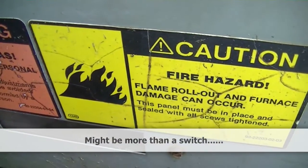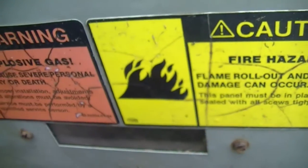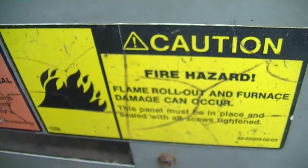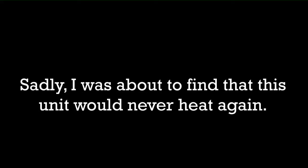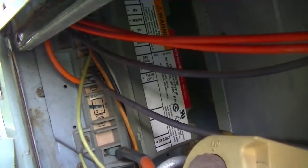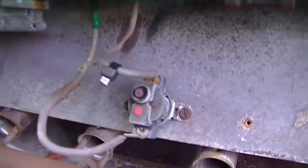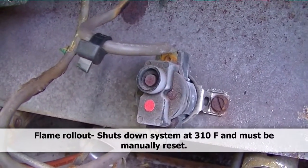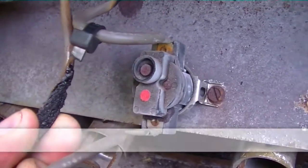The rollout switch is triggered. I know some of the baffles are rusted out, so we're going to see if we can't get this thing to run and give it one more winter before she dies. There's our Honeywell ignition control, our gas valve, and here's our rollout switch which was triggered, cutting power. It also looks like it got toasted — we'll need to rewire that too.